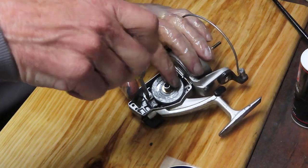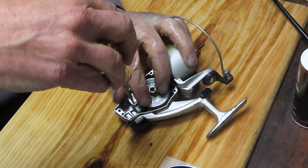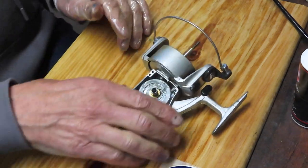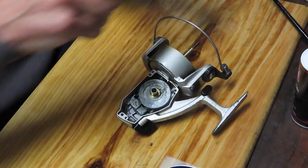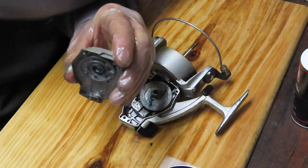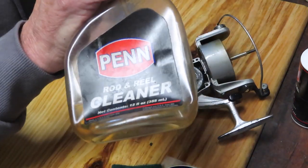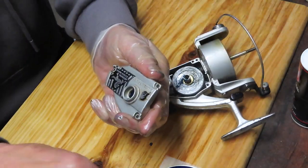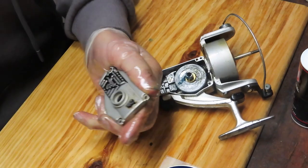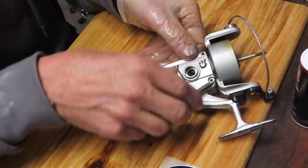Go into your parts tray and get the screw that holds that together — and as those of you who watch me know, little screws and I always have some fun together. Make sure it's tight — you don't want it to loosen and get lost inside the case. Do not over-tighten it; a lot of these are what I'll call pot metal, so over-tighten and you risk breaking it. The case acts as a bushing here, so make sure you get a nice little dab of grease in the tube before reinstalling. Looking at the case, there's a little bit of tarnish — I'm going to use a reel cleaner on a kitchen scrubby pad and wipe it down. That's what I call shellacked grease — it seeped out of the reel and dried out on it.